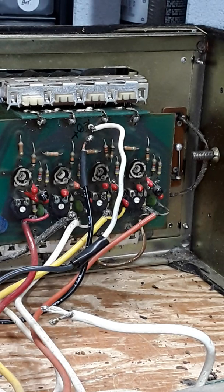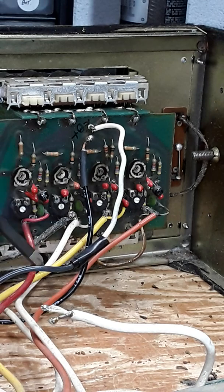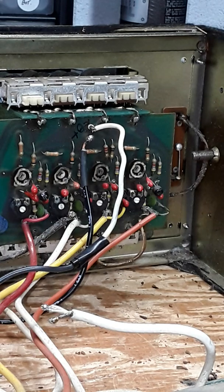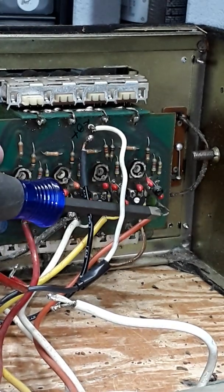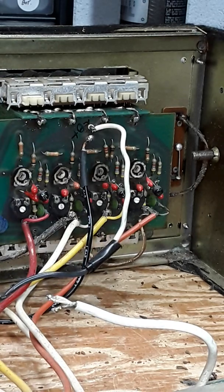But nevertheless, if you do see the colored coaxial cables, look out for two things. One is that it matches or it's white. The reason I say that is I probably had 30 plus units here where I've done rewires and I've used that before. So I hope that's helpful for you. If you see any of these telltale signs in the pictures, this flaking wire here or the coaxial cables with the brown rotting center conductor, sorry, I almost said semiconductor, then you know you've got a problem and you're looking at a pretty major repair to get the thing going.